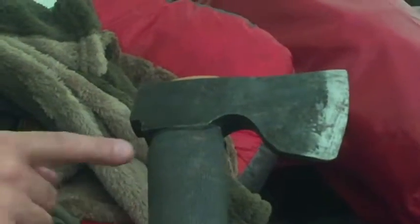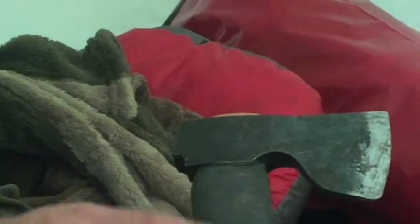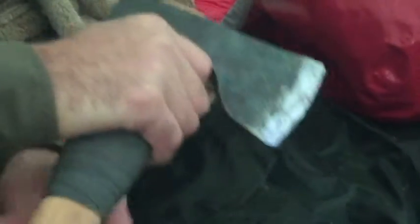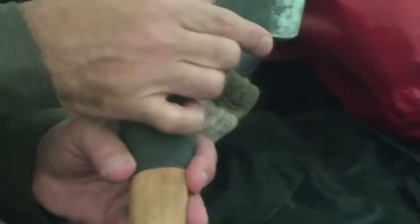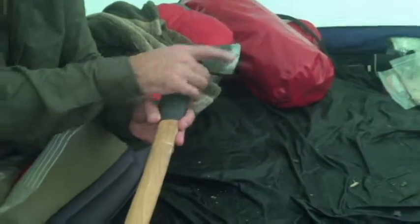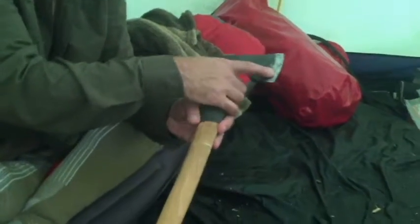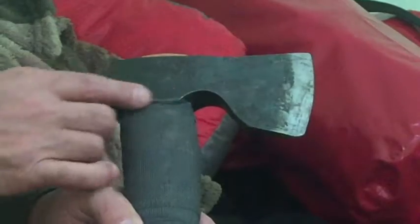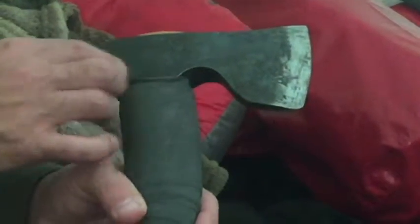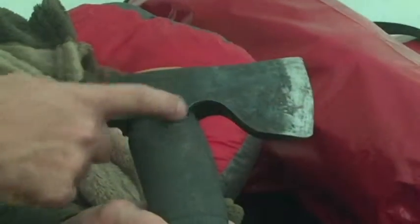I like it a lot because I can hammer on it. It's not leather that will get wet, and it's very strong and adds another 400 pounds. I can hammer on the back of it and still get a nice grip and do fine work. It has a nice two-inch beard on it. From the toe to the heel is three and a half inches. It's got about a half-inch bevel — a nice bevel — and a flat lug. The lug doesn't come down a lot, which is good for getting your hand in there tight. I like the flat lug as opposed to a rounded lug.